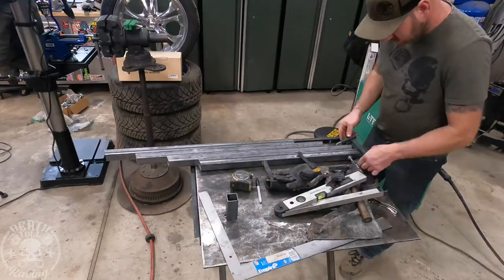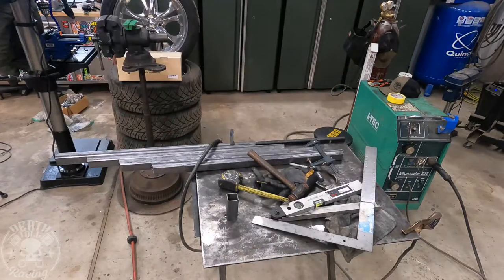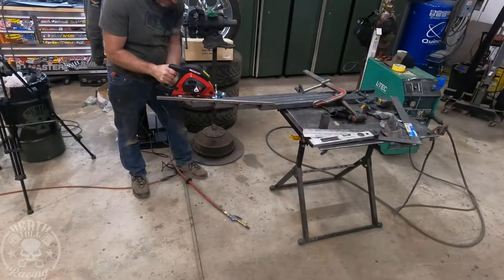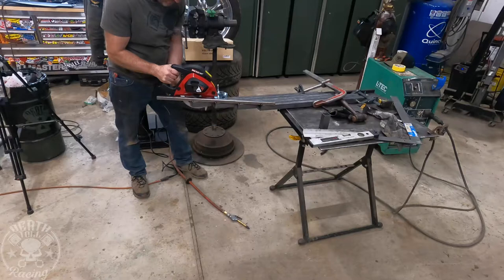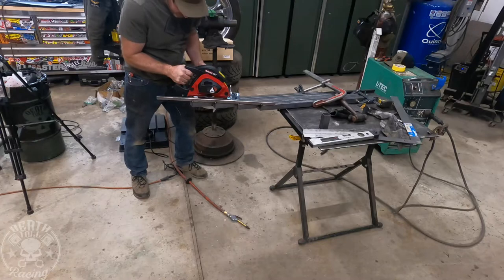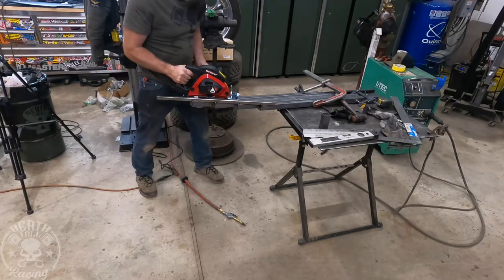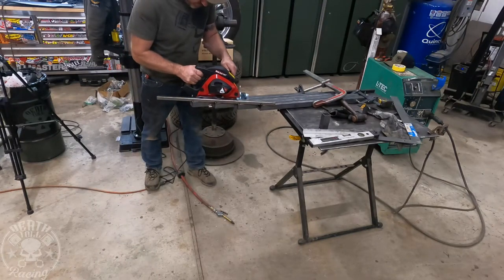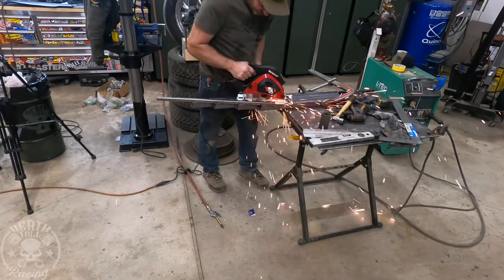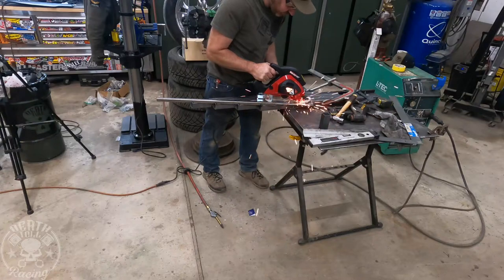What I'm cutting now has a big miter on it. I don't want to leave that just 12 inches wide, because as you're driving up it and flexing, the load isn't straight up and down - the load is actually going to be pushing out, depending on what side of the car you're on. The load is actually going to be pushing out away from the car. So we need to put some legs out on it so that it doesn't just flop over, being that it's so tall. This one is over 30 inches tall, so it definitely will be getting pushed to the side, and I want to make sure that doesn't just flop over.